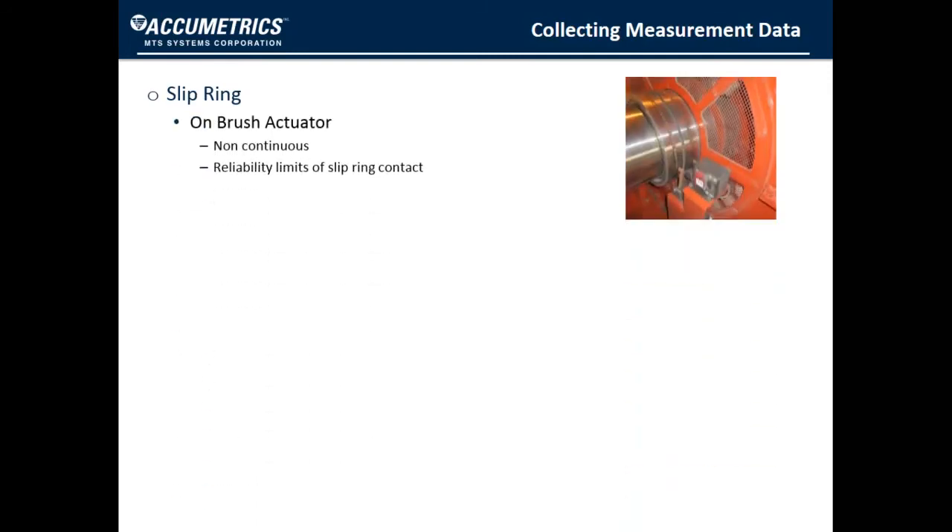Let's take a look at the means of gaining access on a brushless exciter. From the beginning days of brushless exciters, having a ground detector was a problem because getting access to the rotor was challenging. A lot of machines use a slip ring that contacts the rotor and allows for ground fault detection. These typically have a brush actuator that contacts the rotor for a few moments, usually only once or twice a day — it checks for ground faults and then disconnects, so it is a non-continuous measurement. In addition, the slip rings tend not to be very reliable.